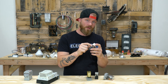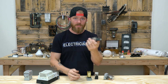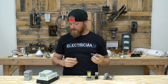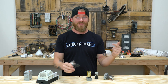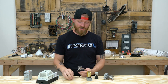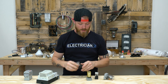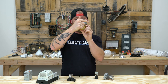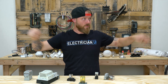It's a 24-volt coil, so what that means is the way to energize this thing — to get it to flip and switch between its normally open or normally closed state — you have to run it with a 24-volt circuit. So you need some kind of automatic circuit or switch that can hit it, but you can only run 24 volts to it. So if you had a photocell, a 24-volt power supply with a switch on it, you flip that switch, send 24 volts to it, it changes states and allows that 240 volts coming in to go out into the field. There are different ones with different ratings.